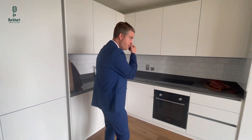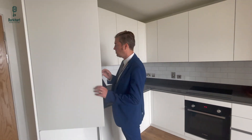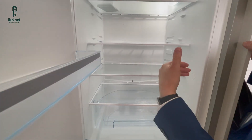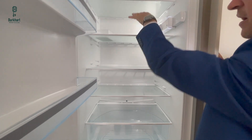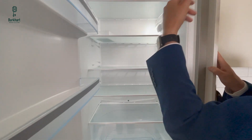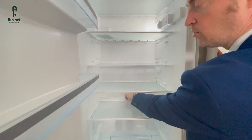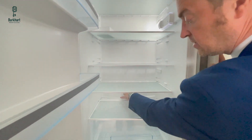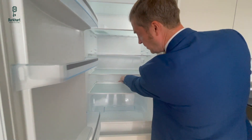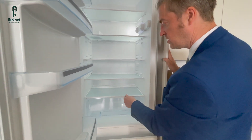All the manuals for the kitchen appliances are on the Spaceable portal. For the fridge and freezer, at the back of the fridge there's a little hole where ventilation and circulation happens — the little droplets you see will eventually melt and go down through there, come back, and melt again, keeping it cold. But if this is blocked up by food debris, that inhibits the process and you'll start to have water pooling, trickling down into the tray, and you might get ice developing. Every once in a while, make sure it's not clogged — use a cocktail stick or a Q-tip to make sure it's able to circulate.